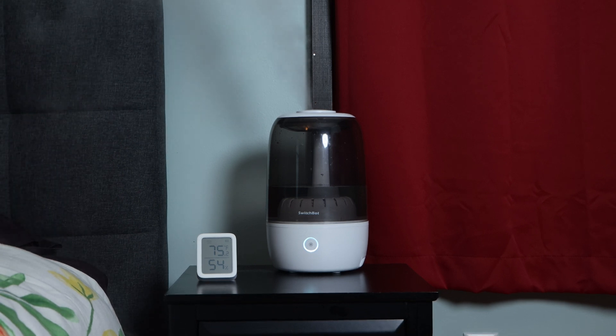Not having the house HVAC and humidifier running not only helps save energy, but with being able to control the amount of humidity within a specific room, it allows adjusting the maximum allowed humidity for that room based on the outside temperature to prevent damaging my older windows. For example, if the outside temperature drops below 30 degrees Fahrenheit, the humidifier will turn off once the room hits 35% humidity. Likewise, if the outside temperature drops below 20 degrees, the humidifier will be turned off once the room hits 25% humidity. As an added bonus, my good morning routine makes sure that the humidifier is turned off so that it isn't left on accidentally all day.